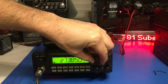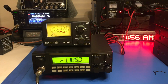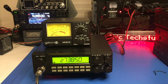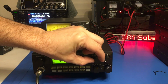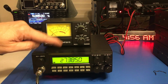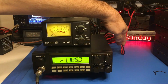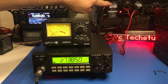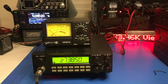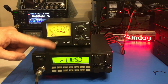And let's go mid scale. 1, 2, 3. Whoa. See, we're getting a little bit of flack on this. It is not keeping up. This power supply that I have is not keeping up with this radio. So that 50 amp, not only is it dirty and splashing, it's not enough to power this one because everything is flickering and flashing when this goes. And using a good power cord right into it. But yeah, all this stuff runs off that dirty supply. And man, I didn't notice it until I started looking on these low bands, on the shortwave bands and stuff, how much it actually just destroys the band, but it also doesn't keep up with this.